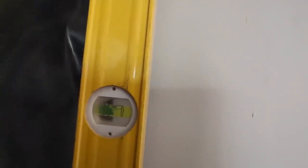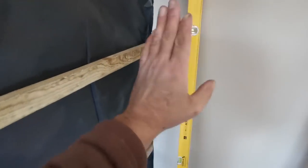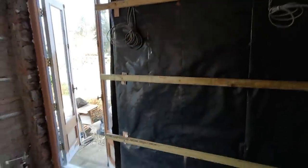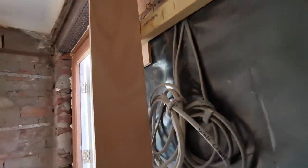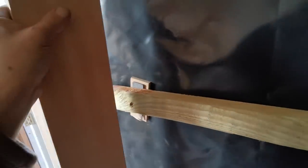There's a bit of a kick in the middle there — it's not far off. Pack that top out a little bit and pack the others to suit. This wall isn't bad actually, it's quite straight as well. That needs to be right because the corner is going to come together there, so that end's good. I need to check it where the packers are because these screws down here I've got to release them — it just pushes them. So that's good, this end's good.